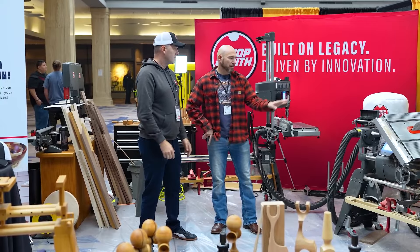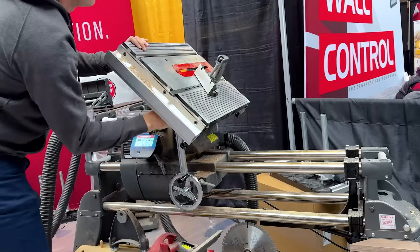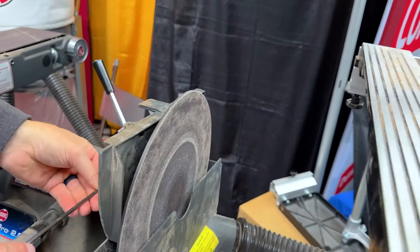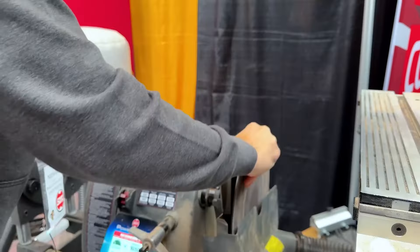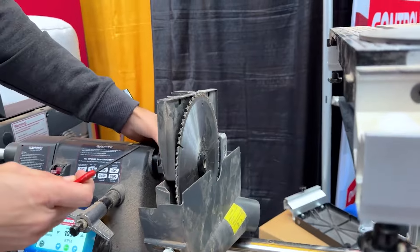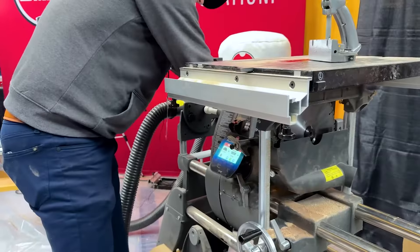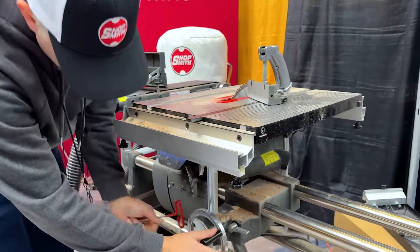So can you show me how this thing works, how you adjust everything? I'll turn it into a table saw. First, raise the table up. What's great is you only need one tool to do everything. There's a disc sander on here now, but it won't be very hard to change this out. You take the disc off, put the saw blade on, line those up — you want the tip back just a little bit so the table catches it. Get everything tight, slide this back over, and it comes right up. There's the saw.